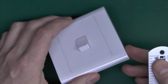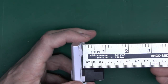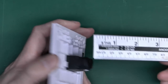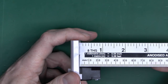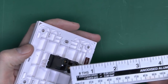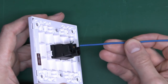This is the Essentials range, and you can see straight away it sticks out massively more than the other one. Checking the stick-out distance — that's around 23mm. So if you've got a 16mm wall box there's absolutely no way this is going to fit. And even with a 25mm you might actually have some difficulty, because again the wires go on the back here, so when the wires come out there is going to be some extra space required for the wire to loop across.